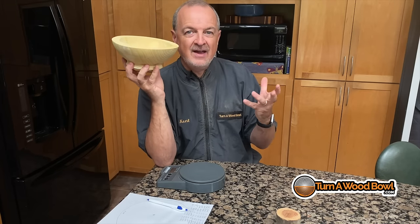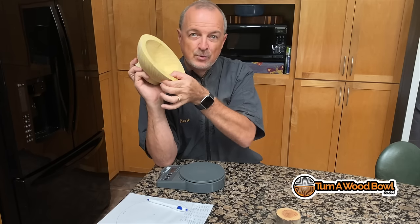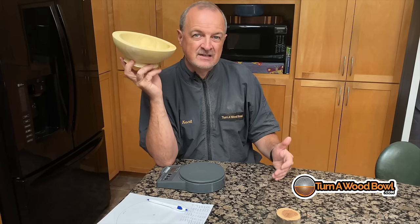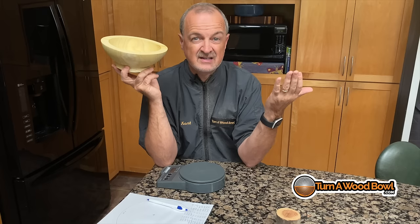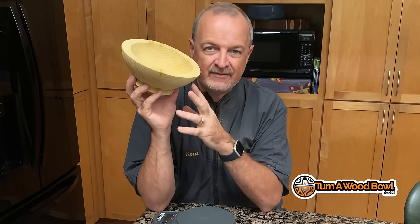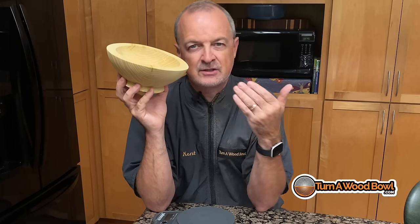So that's how you dry a bowl blank in the microwave. Keep in mind this only takes a couple of days. It seems like a lot, but this is almost an inch thick. The rule of thumb is that an inch of wood left on a shelf to equalize should take about a year. I did this process in about three to four days versus a year — so this is a great alternative for speeding up the drying process. The biggest takeaway is that every single piece of wood you use on the lathe is going to be different. Get comfortable with the types of woods you have access to so you become familiar with how they react over time, and this whole process will be a lot easier.